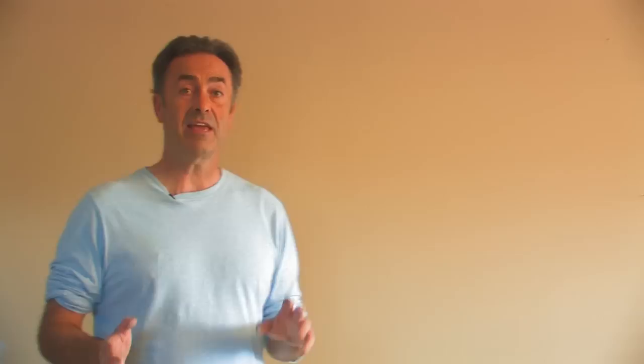Once we have those tools in place, we will start covering the floor with a drop cloth and putting our tape on our baseboard, and then we'll be ready to go. The next step, we're going to use our chalk line to pull a chalk line on both sides. By doing that, that's going to give us a straight vertical line with which we can tape.